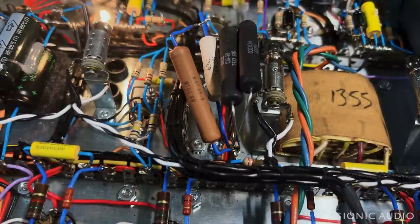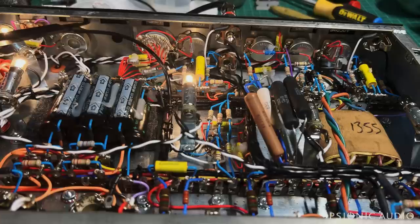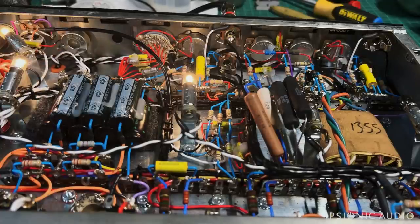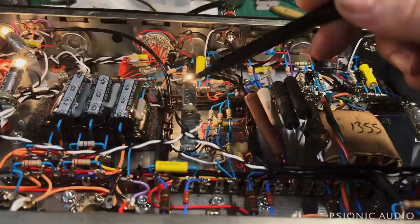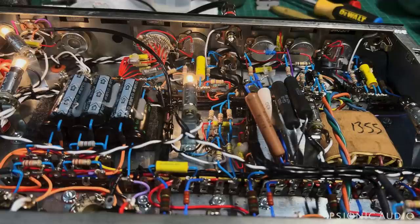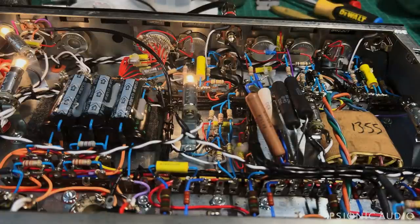I've got a couple of these little bulbs to replace. People ask what these bulbs are for. The chassis has little square cutouts in the metal, and the black plastic front panel is embossed from the front with clear behind it — so, for example, this one says 'volume,' and the light bulb makes that label glow on the front. There'll be another one for the big Matchless logo and the front indicator. In 1980-whatever when Mark was doing these, number 47 bulbs were a fine choice — every guitar supply store had them, they last a good long while, and there's no huge current draw, so they don't affect the heater supply. Probably need to change them every five years or so — no big deal.